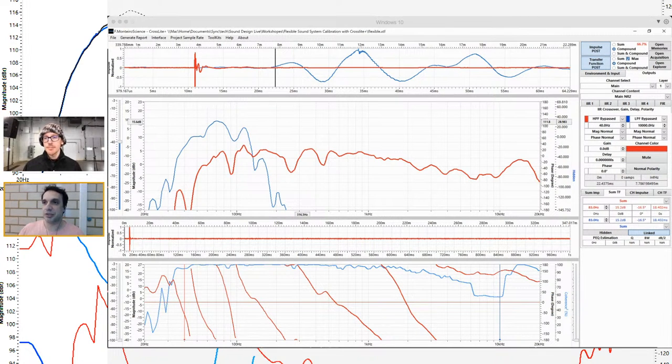When you need signal-to-noise ratio, use log chirp, but if you want to analyze if your system really has big quality according to dynamic control, this is not the best signal. So, for example, music or some kind of different signal with changes, where we don't have a constant magnitude in a sinusoidal pattern. We have something changing all the time. Okay, so just this. All right, thanks, Francisco.